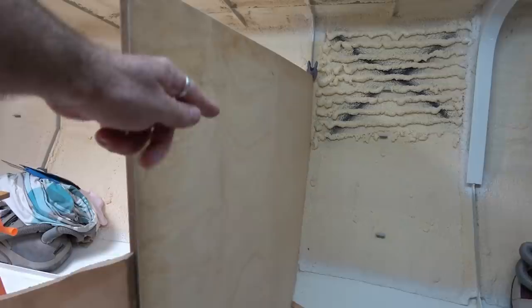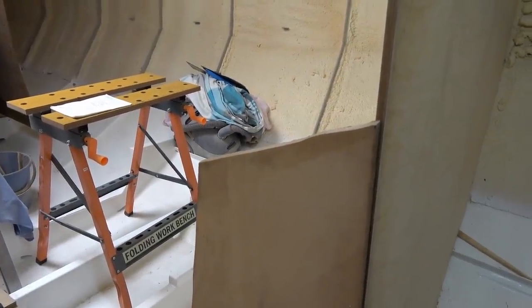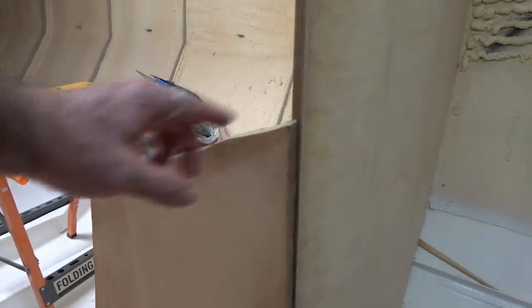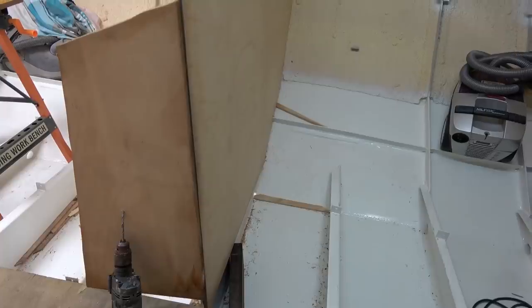I was having a think about how I'm going to place the side piece for the seating. Originally I was thinking the cabinetry for the galley would be separate to the saloon dining area, but in looking at this, to reduce the amount of exposed ply edges, I realized there's nothing to stop me from making the galley cabinetry and the stepped piece for the seating side out of one piece. Having it in one piece will cover those edges and make a continuous-looking side piece.